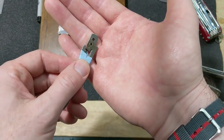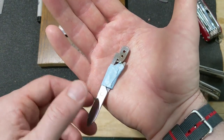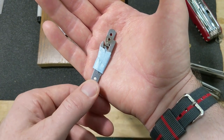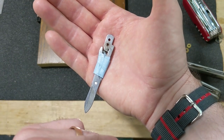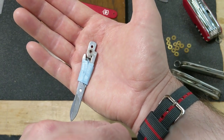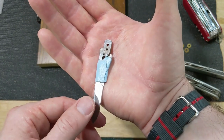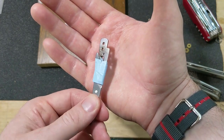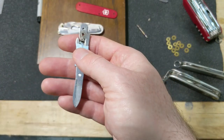Spot annealing definitely helped, but I'm not sure that that's the best method. I suppose if I was going to do this over again, I would spend the time waiting and money to order a carbide bit. They would be able to drill through that probably a lot easier and wouldn't require the spot annealing. And I mean, I still broke two drill bits trying to do that. So, you know, it worked. I'm not sure I would recommend it, but in a pinch, it is a way to get through some really hard metal.